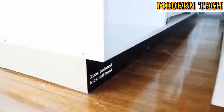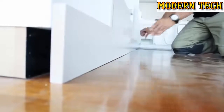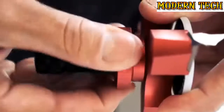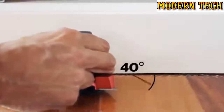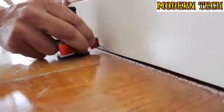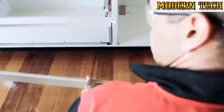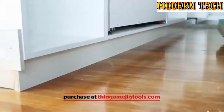Now the benchtop is replaced to show the perfect fit. Here we see a two-pack painted kick rail front being fitted to a timber floor. The kicker front is placed on the floor and set in a level position. Again, the blades of the scribing tool are set to the amount required to be trimmed off. The scribing tool is then held at 90 degrees to the kicker front. Slide the tool across the floor to mark the entire length of the part, then trim with an electric plane. Once again, the paint does not chip past the scribe line due to the scribing tool blade creating a break in the surface. Now the kicker front is replaced to show the perfect fit.